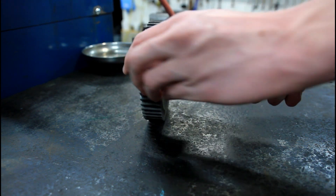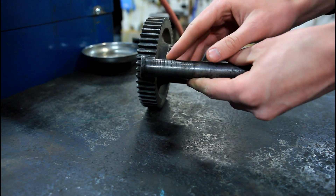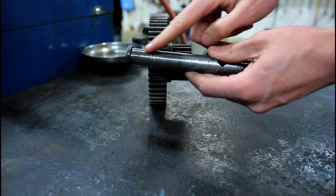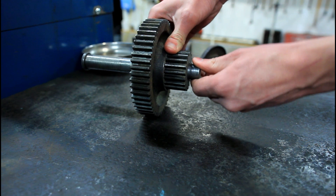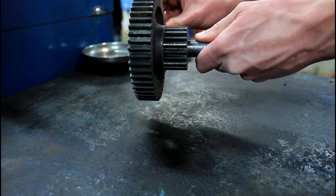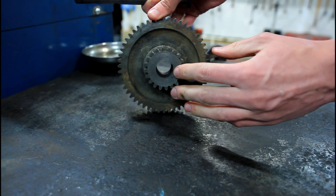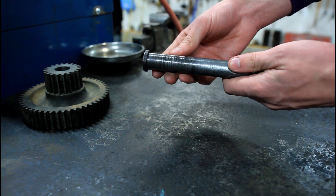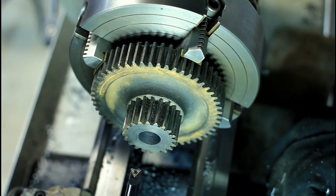One of the things that needs work on this machine is the back gear assembly. The problem is that this shaft is just a plain steel shaft going into an iron gear — it was under-lubricated and has some pretty deep scoring, and both are worn. You can see the shaft is fairly loose, and when it goes in all the way it's a bit too loose for my standards. What I'd like to do is bore the inside of the gear out, then braze the shaft and machine it back into shape.